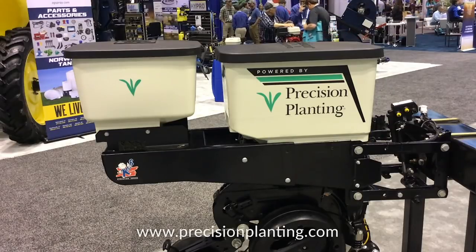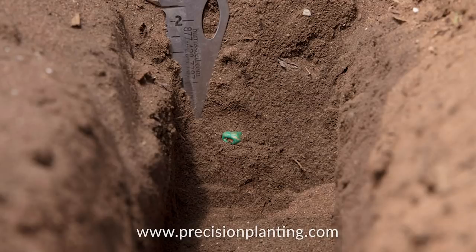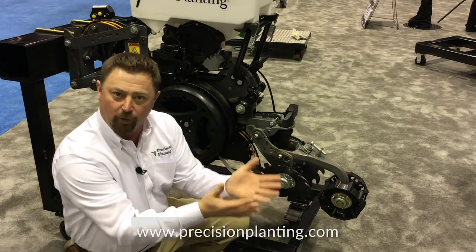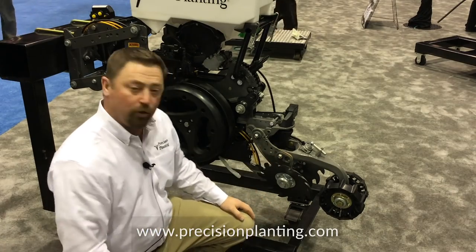What we're introducing as a beta product this year, 2019, is a product called Furrow Force. Furrow Force is a way for us to close the trench. No matter what the planter brand or how many rows we have, we're all creating a furrow where we ultimately plant seed at the bottom of the trench. The closing system is designed to blow out the compaction caused when we made the furrow. Furrow Force is a two-stage system: the first stage has a sensing ability so it knows how much force is needed to lift, fracture, and collapse the furrow created by the openers. The second stage is designed to remove the air pocket, stitch that trench together — which is a really agronomically sound way to close the furrow.